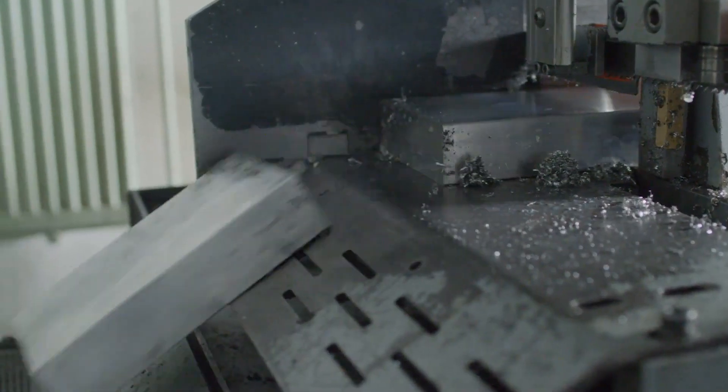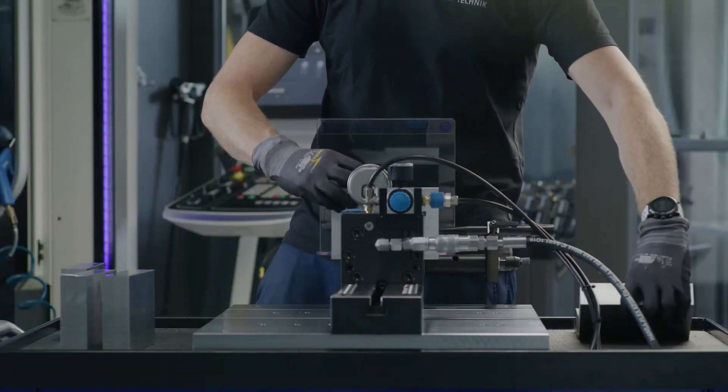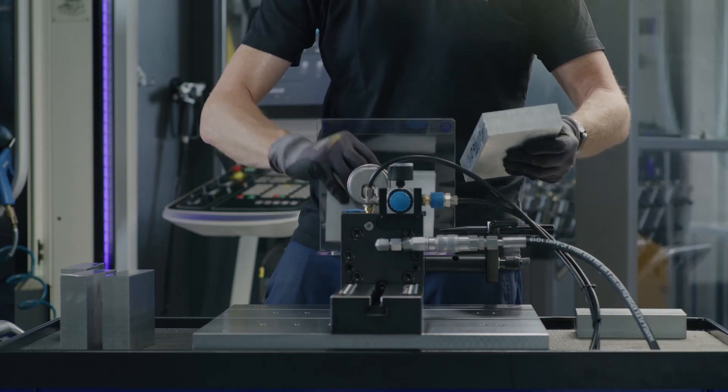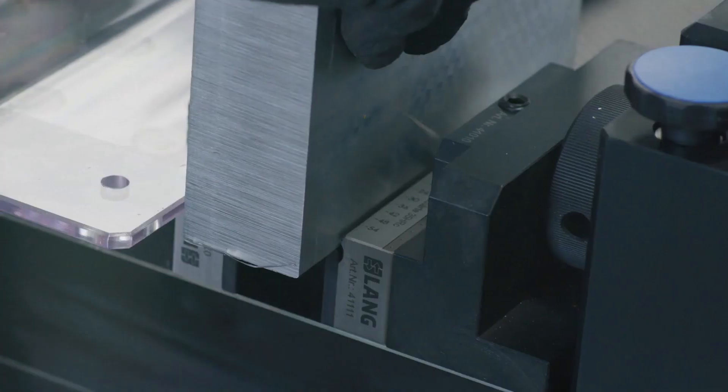Exactly. To stamp the part, you're doing it offline — you're not taking up machining time. Your operator doesn't have to worry about it. By stamping, all you're doing is putting it into your stamper — three seconds and you have it done. It's marked, it's repeatable. So even if you have somebody just starting in the industry and feeling their way around the shop, they can get all the parts prepped and ready for your operators on the machine. That durability of stamping, being able to put that in — we prefer customers to use a stamper because that's what it's designed for. It just gives you wonderful results.